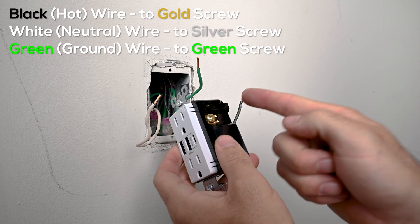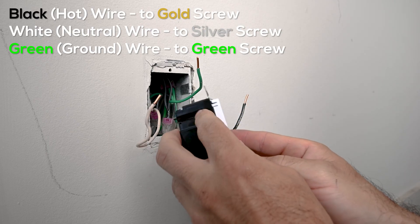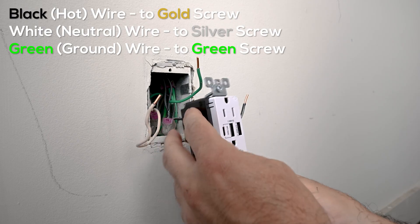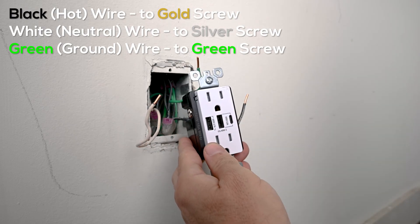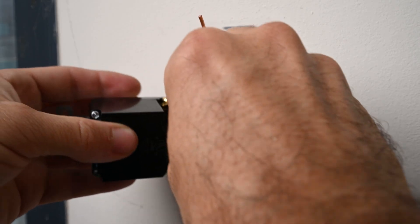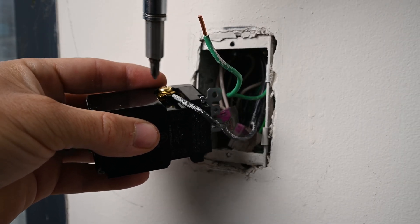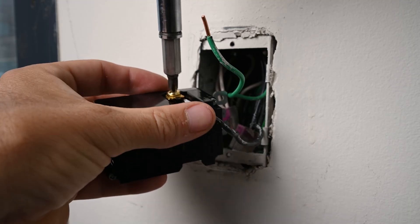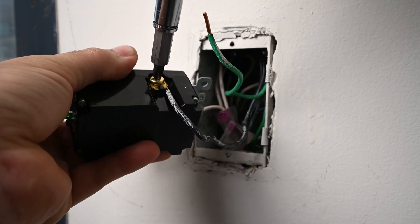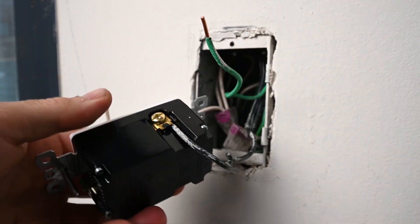The gold terminal is going to be your black wire on your right. If you're looking at it, your neutral is going to be silver, and the green wire goes on the bottom to ground — we're going to be installing this ground down. Insert the wire under the plate just like that. The screws come all the way out already. Get it very snug, give it a tug — she ain't going nowhere.